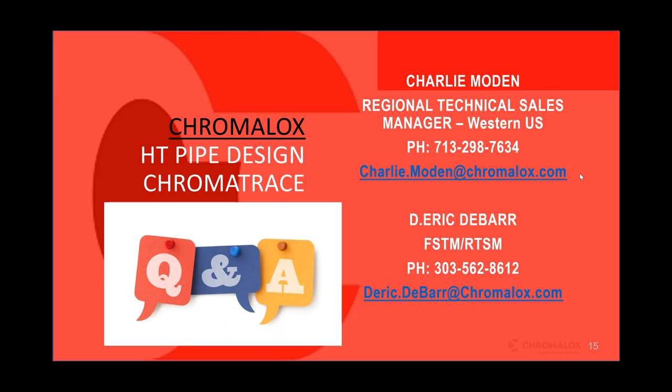A control limited design just means that you're going to add some type of control on the line itself to limit the output of the heating cable. That's all a control limited design is. If you don't want, like a corn fructose syrup line, where you don't want to exceed 150 degrees or 160 degrees Fahrenheit, whatever may scorch the actual product, you can use that control limited design and say, look, I never want this pipe, even in a runaway condition, to reach this temperature. By adding additional control to it, you can come up with that end result. So that is basically keeping you from over designing a heat trace circuit.